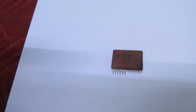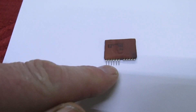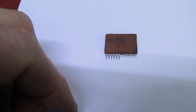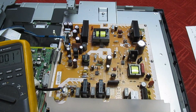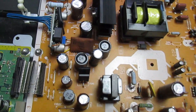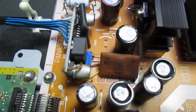I've cut off the last five pins and just left the half that's working. We're going to replace the faulty half with this standalone switching converter. That's the new converter fitted in — there's the chip we took out — and the converter is stood up just behind the connector for the inverter power supply, so it doesn't actually look too much out of place.